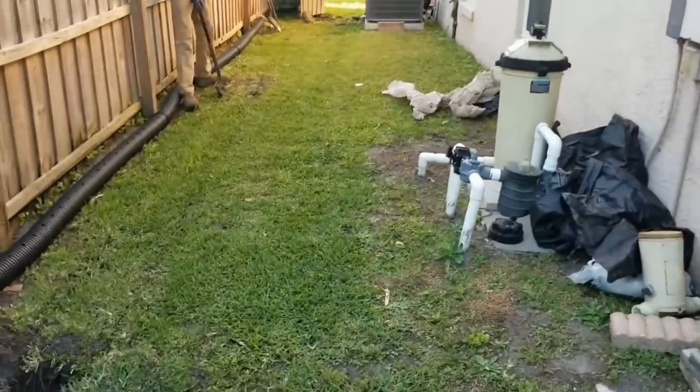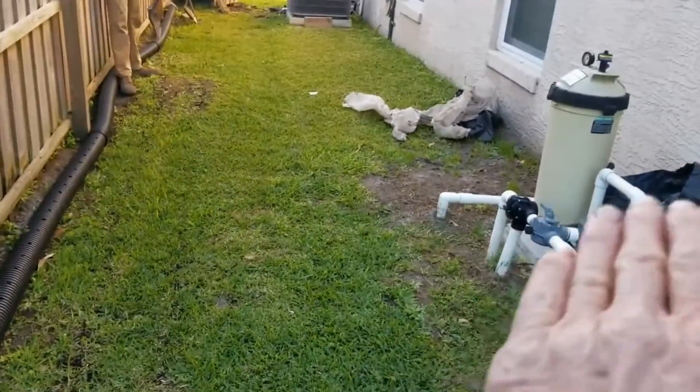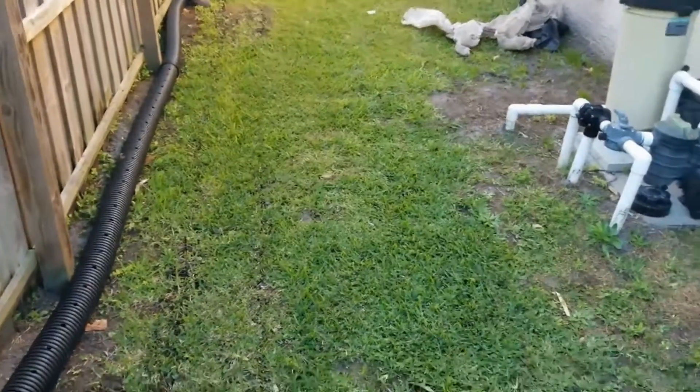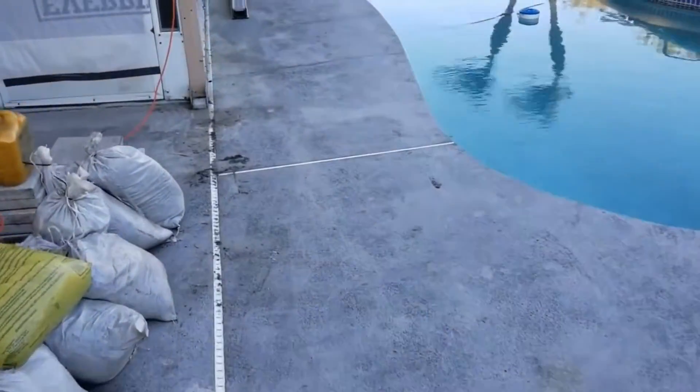In addition, we're going to go ahead and put in some French drains along this side, because from the grade you can see this water just sits here from both homes — it floods pretty badly. During the hurricane she had a real flood, came inside the house through this area back here, and that's what prompted doing all this work.